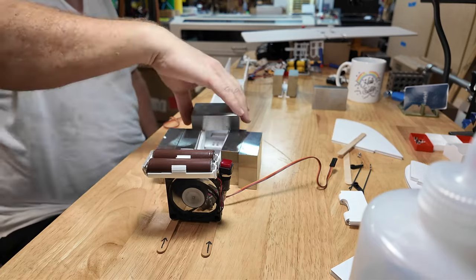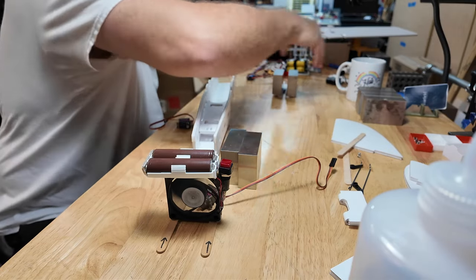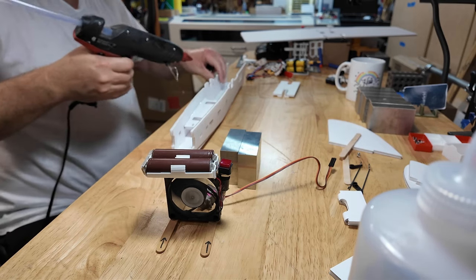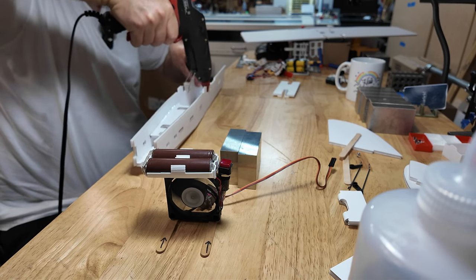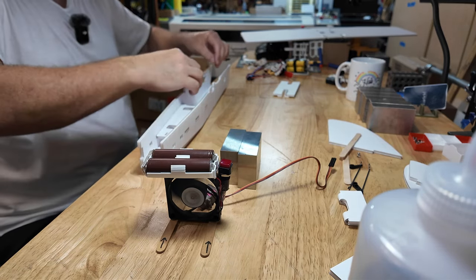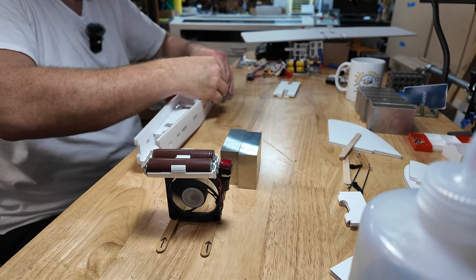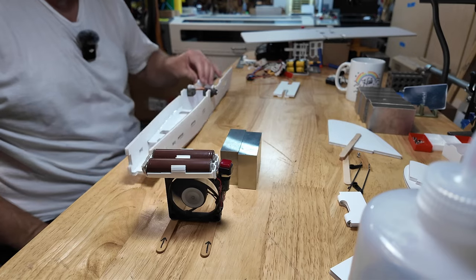Okay, here we go. Pull these off. Okay, kosher. Put in some servos. So I'm just going to put some hot glue on the underside in there where the servo's going to go. The servo's actually very well attached on both of these because remember, it's going to have glue on the top and the bottom. So the wiring is going to go forwards and that just snugs in like that. And the other servo, which I put here, the wiring goes forward. Control horns on the outside. There we go.